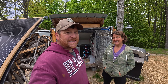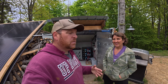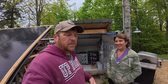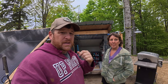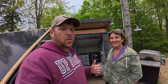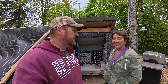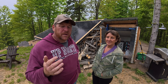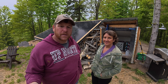The battery has wires running underground to the cabin, feeding our only 12-volt device — the water pump. We have a switch to turn the water on and off when we're away. The battery is currently at 12.1 volts, which is pretty low since the turbine hasn't moved much in the last week. But that battery will last about a week for our 12-volt pump since it only runs in short bursts when we're showering or using the faucet — the SureFlow pump is around 100 watts but doesn't run 24/7.